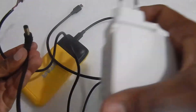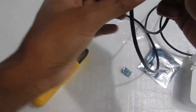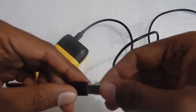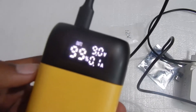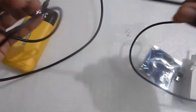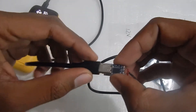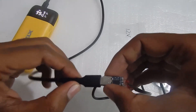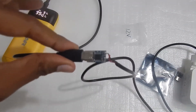Let's plug this one in and see whether it gives us 9V. On the power bank you can see this one is triggering 9V without any problem. Now let me plug this cable into my modem. I will connect a small thermometer probe and we will see how much it heats up when running the 9V modem — I'll also be running the Wi-Fi on the modem and we'll see how long it runs without heating too much.